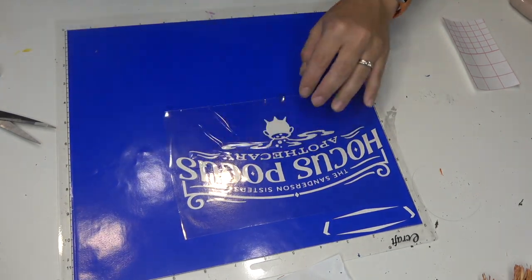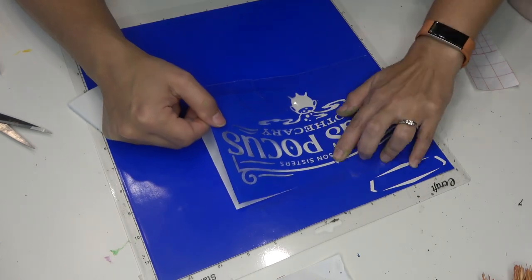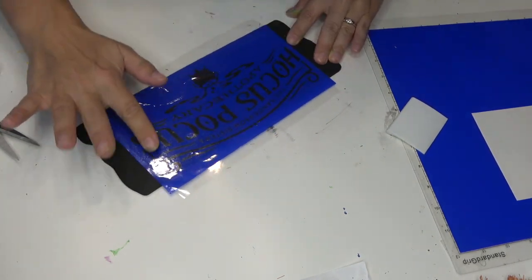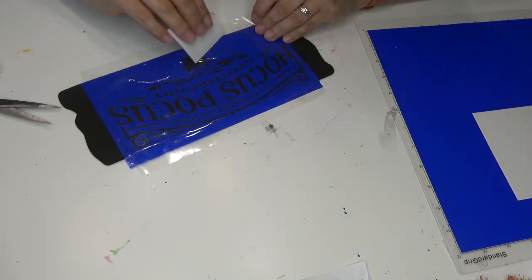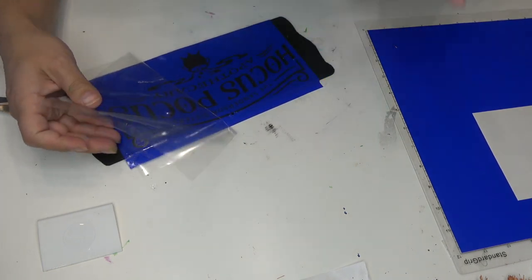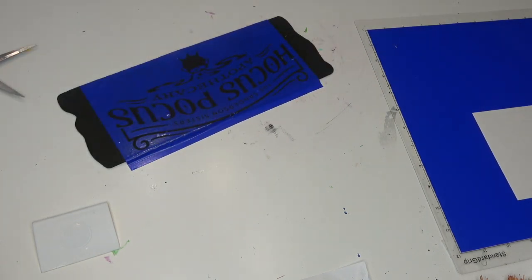I took some transfer paper and I'm laying this down as a stencil - I'm not making it permanent, I'm laying it down so I can actually paint the sign. Unfortunately I laid my stencil a little bit too high up on my sign. I also already did this one time with a different template and really didn't like it, so I repainted the entire thing in black chalk paint - this is attempt number two. The reason I'm telling you that is because I was impatient. I gave the chalk paint maybe 10 minutes to dry then went right in with the stencil, so it pulled up quite a bit of paint. Just be patient and give it plenty of time to dry.